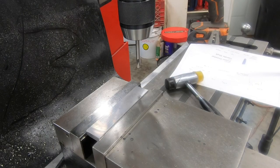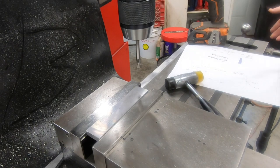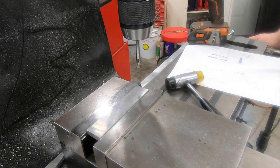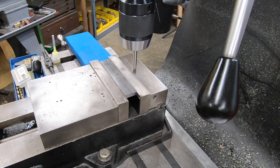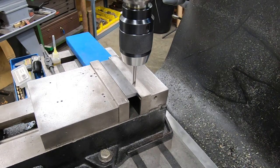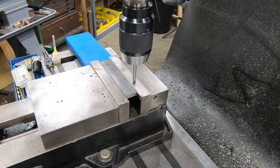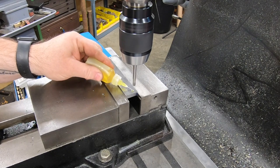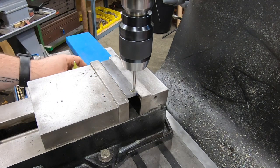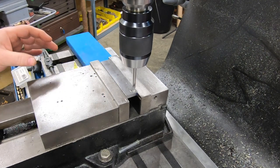Since I'm on center of the part, I'll move the saddle over half the distance between the two holes and then move my table down to the right distance from the top edge. As you've seen many times on my channel, if you've watched the series of this accessory being built, I'll start with a 120-degree spotting drill.